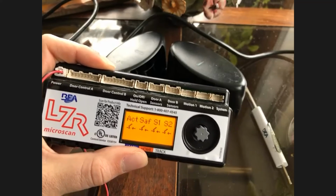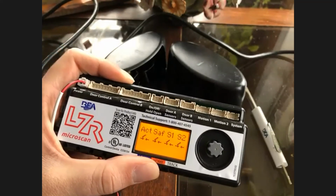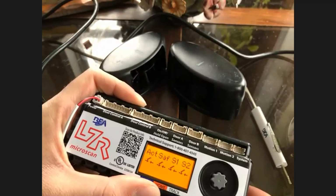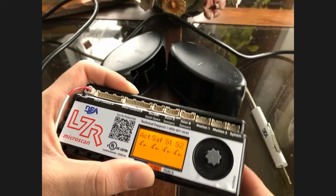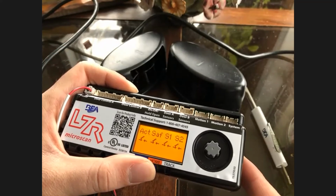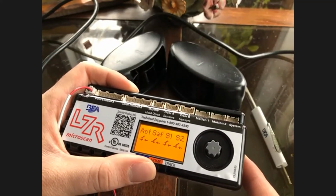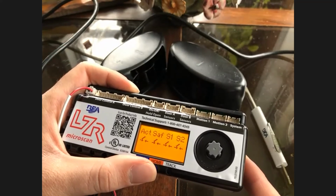You want to retract it, drop the change. If it was 36.5, you drop the half inch and then minus 1 inch, so it'd be 35 inches. So it does not see the jam, and theoretically it is not going to see anything as it opens and closes. And the swing side does have the ability to learn a wall and learn a guide rail as long as you set it on 1 or greater.